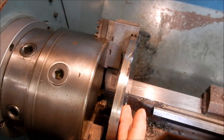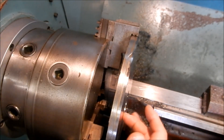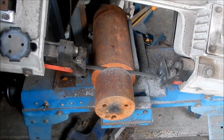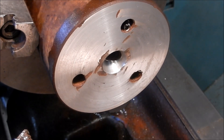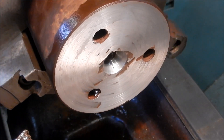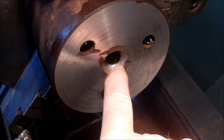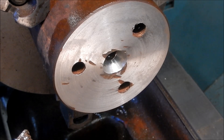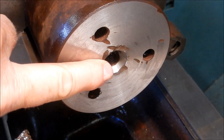We'll get this out and make up a mandrel to fit it, and we'll look at the options for cutting the keyway. I'm just cutting up a bit of stock to make the mandrel from. I can see this hole is about three to four millimetres off centre — the chamfer hasn't cleaned up all the way around one side, and you can see how deep it goes on the other. I'm going to have to get that hole trued up, because I want to drill and tap it to fit a cap screw to clamp the plate on and hold the gear in place.